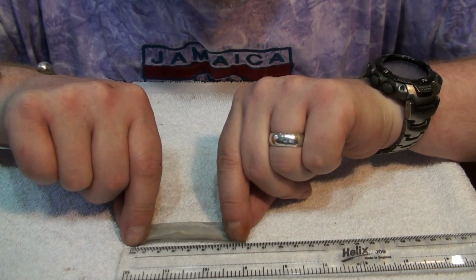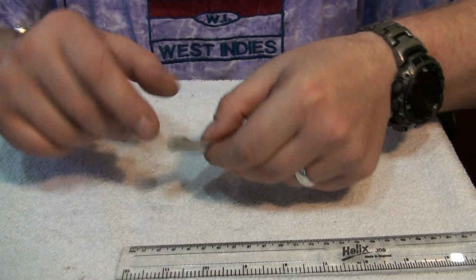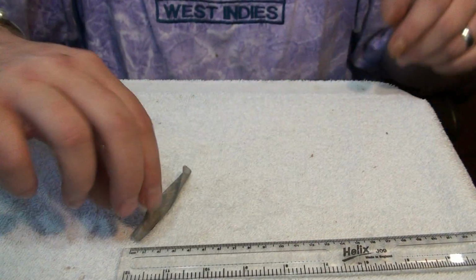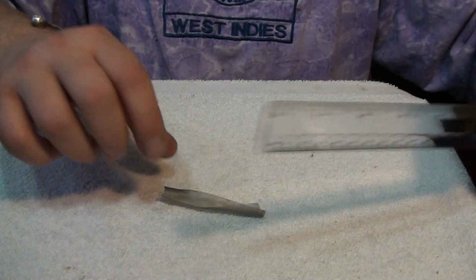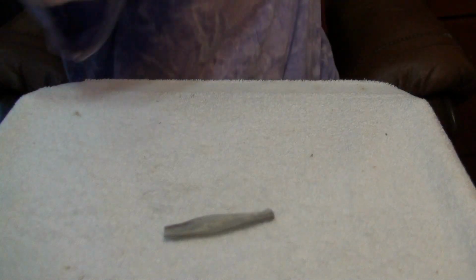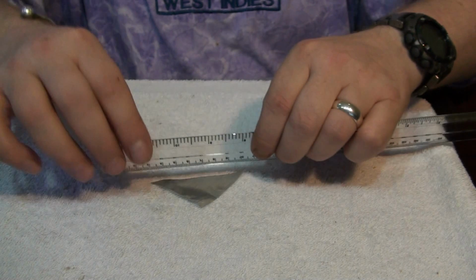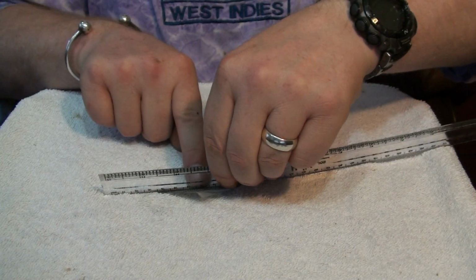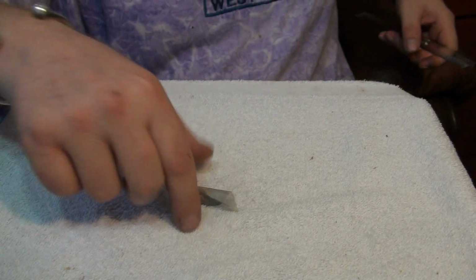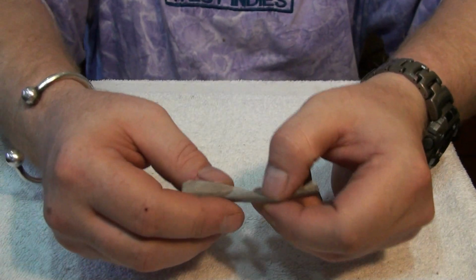By the reviews I've seen, it's around about 75mm, so I've cut this at 75mm long, and also about 18mm wide. And all I've done to start the bend, it was a good technique: you put it on a piece of flat, put your ruler on, pull it across, and it starts it rolling for you. So what I'm going to do is try folding this now.